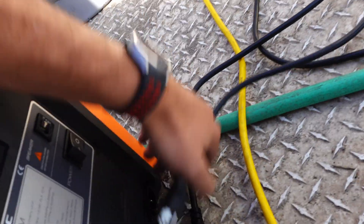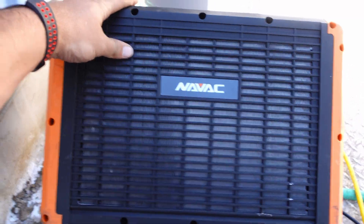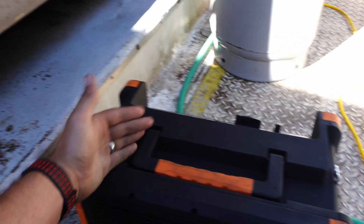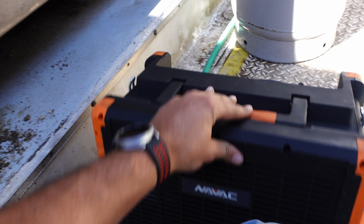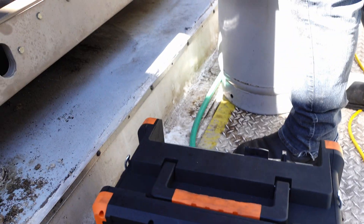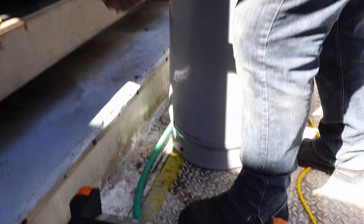Continuation of this call — we're hooking up our recovery now. This whole back panel here is a micro channel coil and they've got some serious fan on the front. You might not need a subcooler with this because they have such a good subcooler built into it. We are not going to do that today. We are going to hook it up and try to run it and just see what the recovery does in the process.